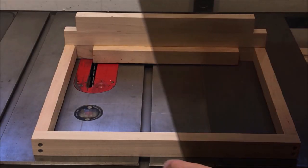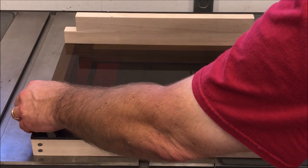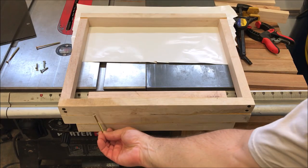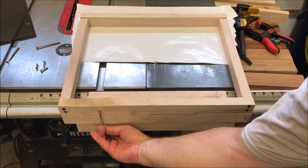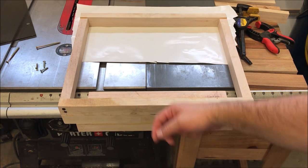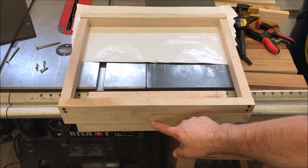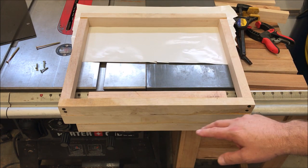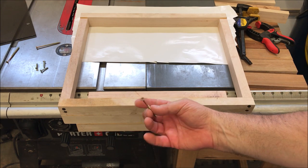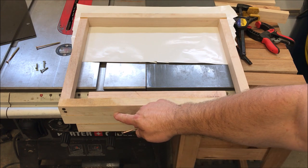With the frame built and the plexiglass cut to size we can now turn our attention to attaching the plexiglass to the shelf. I've got some three inch screws and I'd like to countersink them so they go about a half of an inch into the bottom board, so I'm going to have to countersink about a half of an inch into the top board. I want to put three of them and the idea is the center board here is where the screws will be into the studs of my wall, and this is going to give it a little extra support above and beyond the glue. However, I would be willing to bet that the glue is every bit as strong as, if not stronger than, these screws.